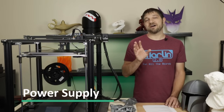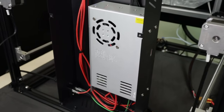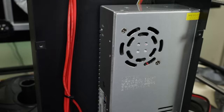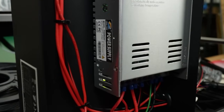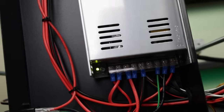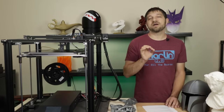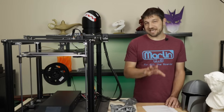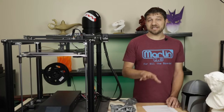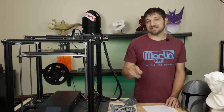Last but not least, let's talk about the power supply. They've stuck with the Chang Lang power supply — the same lowest-cost Chinese power supply seen in other printers. It's presumably why they switched from the Meanwell, which is more expensive. Importantly, TH3D did a video noting that in their printer, the power supply was not properly grounded — both a safety concern and a potential electronics issue. I'll link to their video, and I'm going to check my own printer right now.